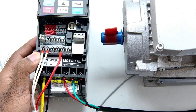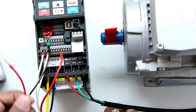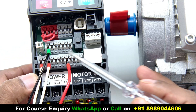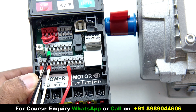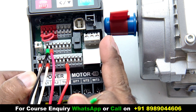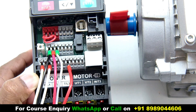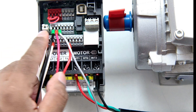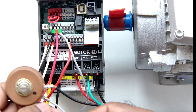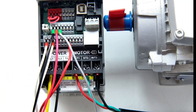My potentiometer here is working a little upside down, so I connect the black wire to the 10 volt terminal. There is also a red wire connected to the potentiometer terminal that needs negative power supply. I will connect it to the ACM terminal of the VFD — ACM provides negative power supply. So I connect this red wire to the ACM terminal. Now I have to give a signal to the AVI terminal through voltage to control the motor speed, so I take the gray output wire and connect it to the AVI terminal. That is all the connection needed for this potentiometer.